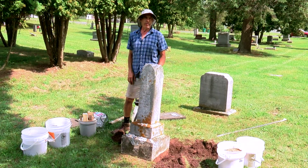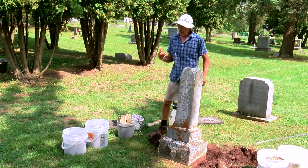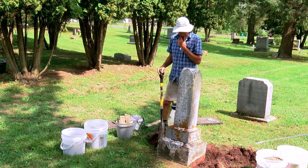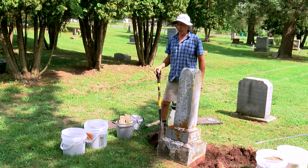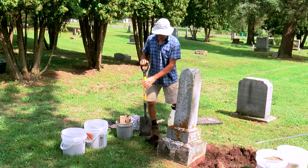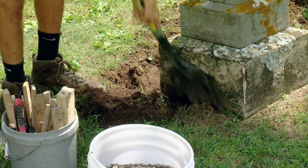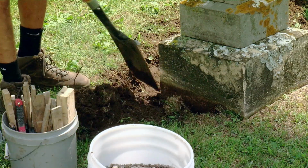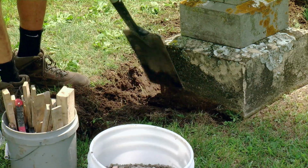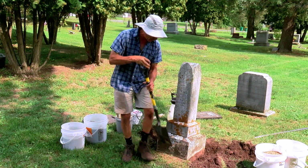On a modern monument, the idea of a foundation would be to eliminate that, if possible, by doing a deep foundation under it. However, in historic monuments, rarely did they do that. And so, regardless, things tend to get pushed downhill through the forces of nature. Another thing you could observe is things like telephone poles and fence posts that were originally installed plumb straight up and down will tend to slowly lean down the hill. And so that's what we have happening here.